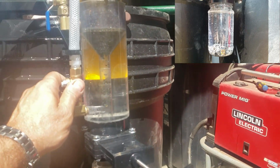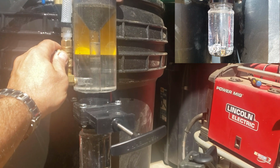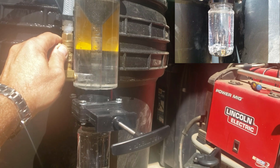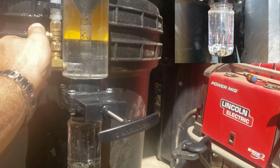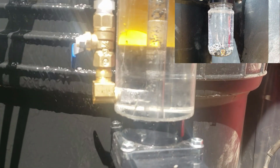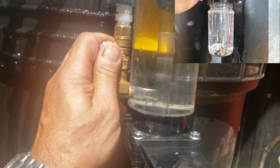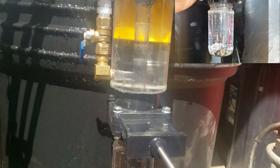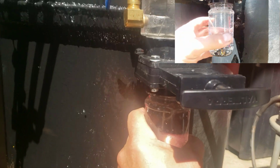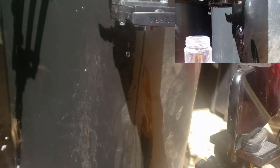This knob that I'm adjusting here is the elutriation, and it's very, very minute adjustments to get it to drop more. I'm just barely moving that, and you can see how it immediately changes the amount of heavies that you're allowing into the system. But I don't see any extra gold coming in. It seems like we've already got all the gold. So what I'm going to do is turn that up, and then let's get a gold pan and see what we actually do have from six scoops.